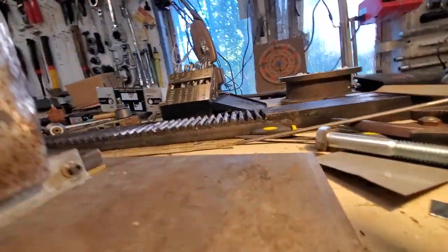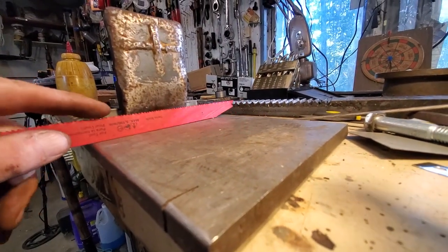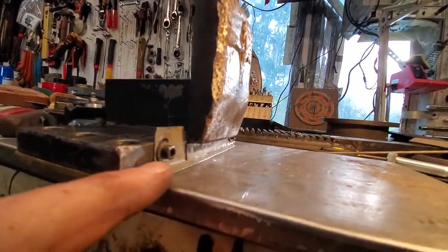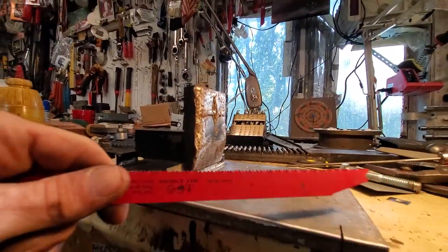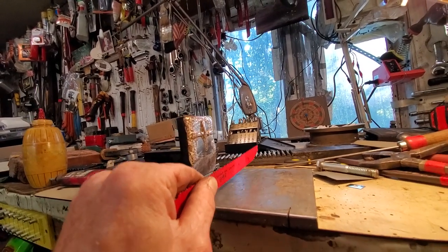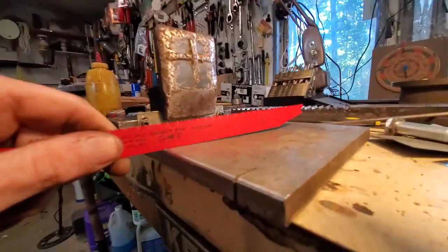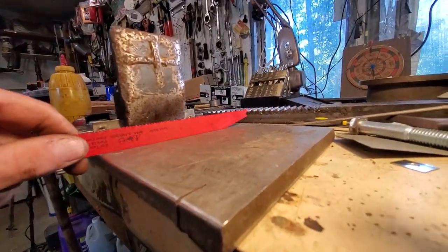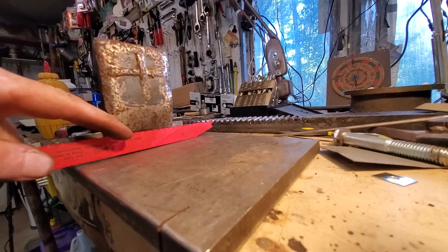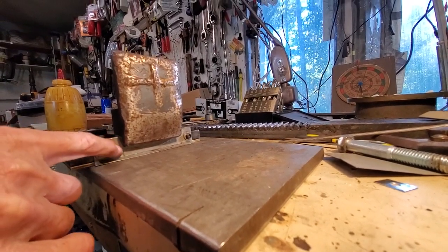The ideal material I want to use now that I've had more time working on this is a Sawzall blade. I don't want to have the snow plow aspect built into this — I just want it to gravity drop and slide along and basically follow the profile of the I-beam. It's going to close off that minor 150-thousandths gap that occurs often enough for us. And it's the right height to cut up, drill a couple of mounting holes, and let it substitute the concept of this entire piece.